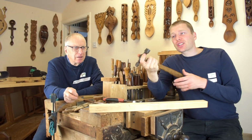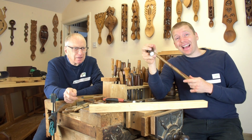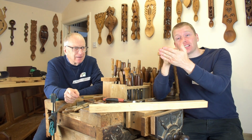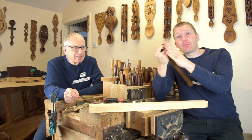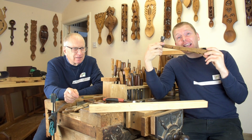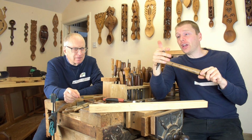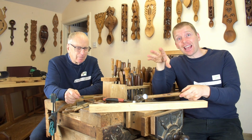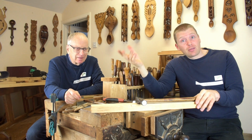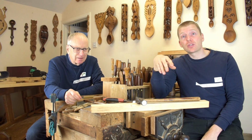So there you go. That's just a little insight into sharpening a hammer. It's not a wind-up, it's a genuine thing. We actually use a little bit of emery cloth on that surface to get it nice and flat, nice and shiny, and that reduces the chances of you hitting your finger or thumb. As mentioned then, selecting the right hammer as well for the right job. The bigger hammers for bigger nails, the smaller hammers, the pin hammer, more for those smaller nails.